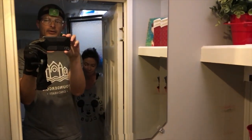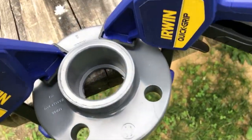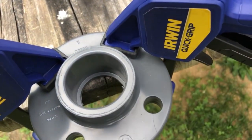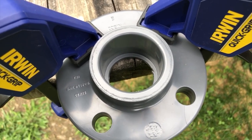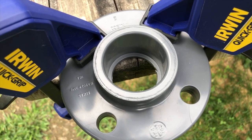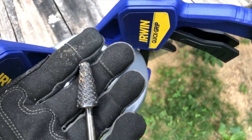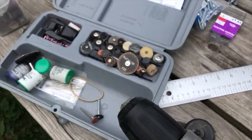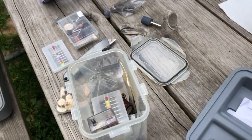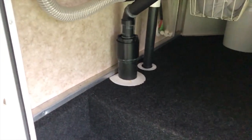Heather just got up from a nap — what do you think? The next step is to shave out a lot of this plastic so the one-and-a-half-inch pipe will actually slide down and be secure but not fall through. I'm counting on the floor fitting to keep the pipe from sliding through. I've got a couple of interesting bits to try, and if all else fails I've got an assortment of Dremel tools and bits, so we'll get the job done no matter what.